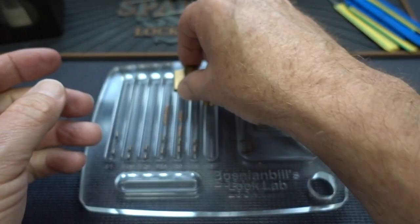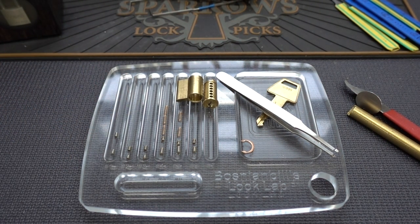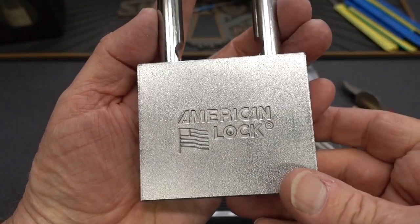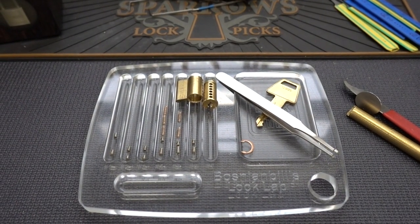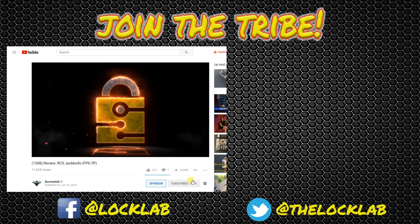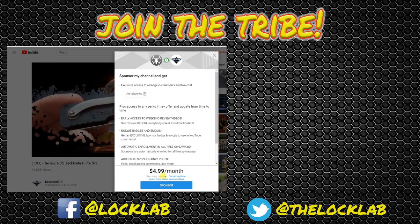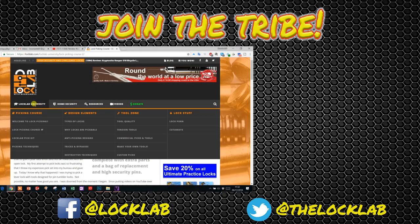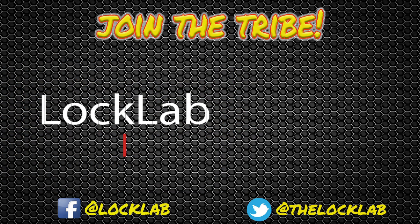The only difference is we did some undercutting in the last three chambers of the bible and the last three chambers of the core. We did it with a four-dollar tool, and it took fewer than ten minutes, and it greatly increased the picking resistance of this massive American Series 790. Anyway guys, appreciate your time. Stay safe. Stay legal. Click that subscribe button, and click that notification bell as well. If you'd like to be a sponsor, for five bucks a month you get all kinds of benefits. Hit the Lock Lab - we've got a self-paced lock picking course with over a dozen modules. Join the tribe.